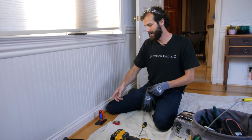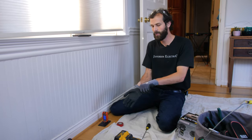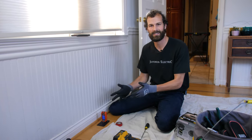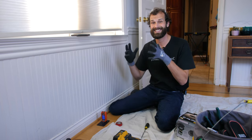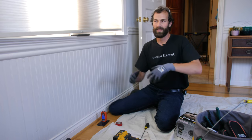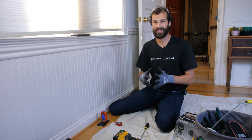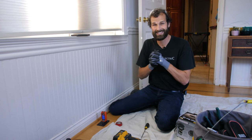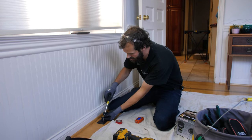So I've got my tester in here, and on my tester, there's a readout of 123 volts. I want to make sure before I get started on a project that I'm taking some tests and measurements of what's existing. So at the end of the project, if I'm testing and I'm running into issues, I know whether it's an existing issue or whether it's a new issue, and that's going to give me a lot of insight into diagnostics and troubleshooting. So at this point, my power's shut off.